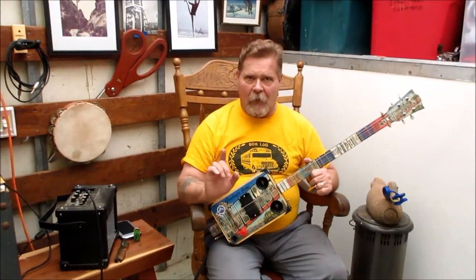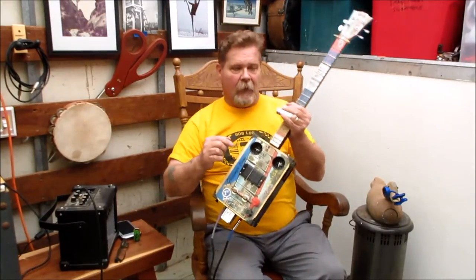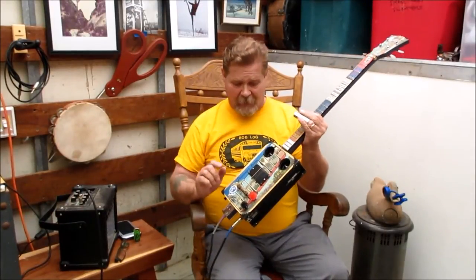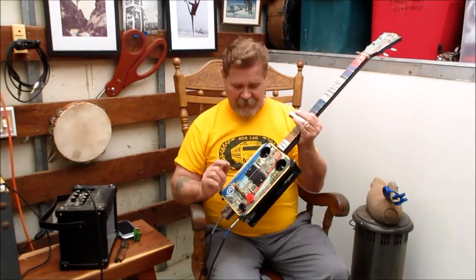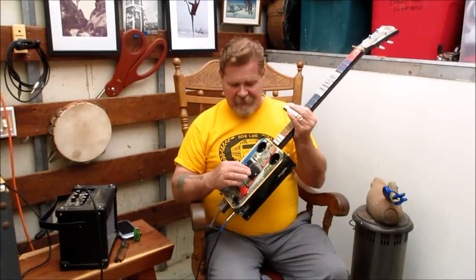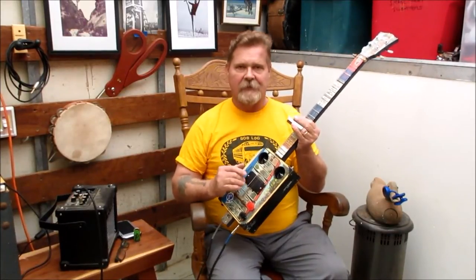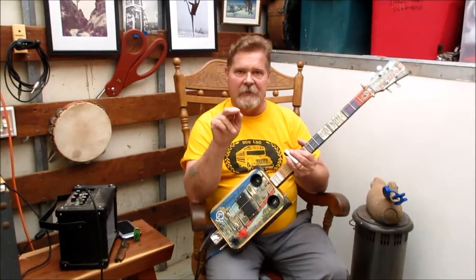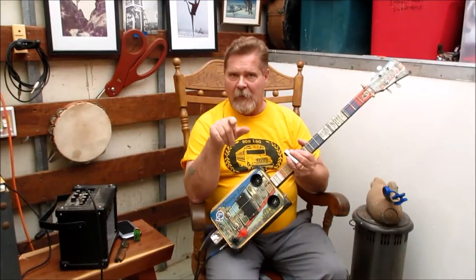The coil works by magnets surrounded by a wire that's continuous for about 10,000 wraps, and when you strum the guitar it's sensitive to the space between the strings and the magnets. The piezo is a brass disc with a ceramic piece on top, wired to read vibrations.